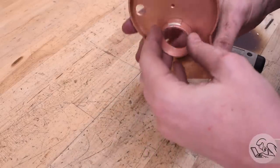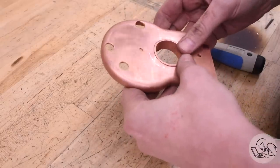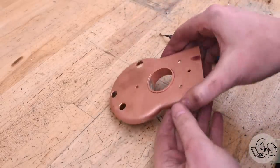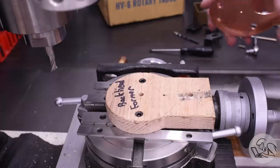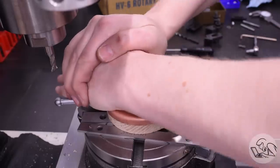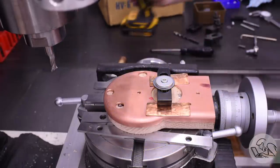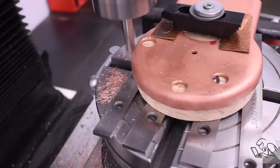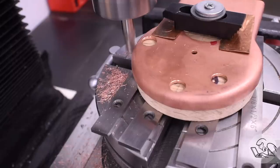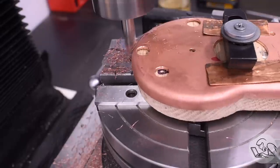That went quite well. It's supposed to stick through the back head a little bit and then bridge the gap to the firebox sheet on the other side. Just like the tube sheet, the curved sections of the back head need to be machined, and that's where the former that we made before comes back into service. I countersunk some bolts in the top of it there so I can just bolt it directly to my rotary table. And then a single wood screw is enough to hold that down. And once again, I can machine this to dimension quite easily here. As I did when I made the formers, I just calculated the stopping angles for this rotary operation by sketching it out in CAD, which for me is much quicker and less error prone than doing the math and trying to calculate it that way.